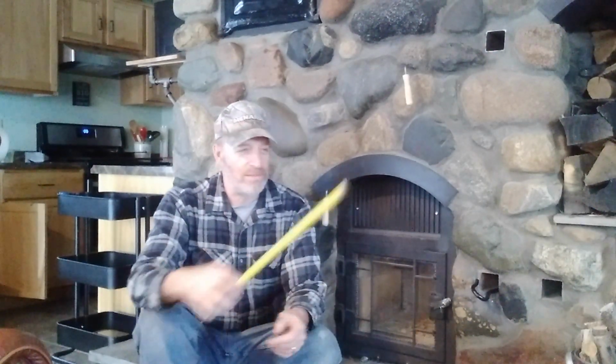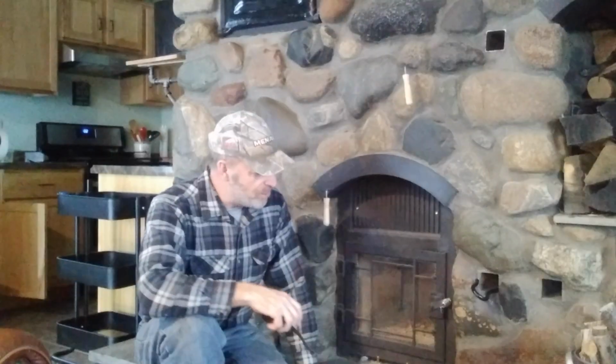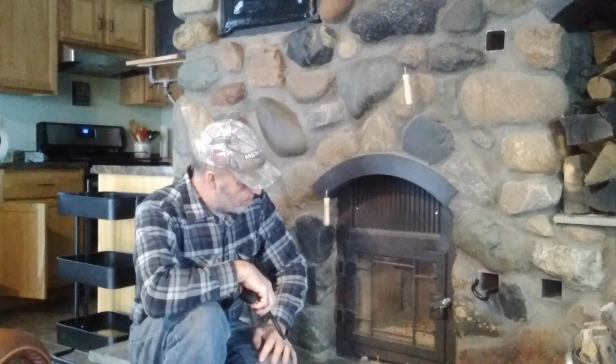So if it drops below that temperature, it'll kick the boiler on. The house is about 55 feet long. In order to get heat from this down the hallway, I do have a ceiling fan to help push it along down there. The fire's out now, but the interior is still about 200 degrees. The fire brick on the inside is the thermal mass I'm using. The last fire we had was last night. It was probably out by 9:30, but I probably burned it maybe 4 hours yesterday.